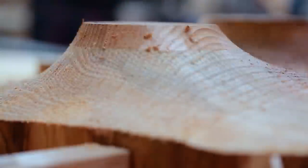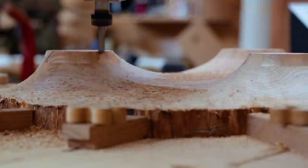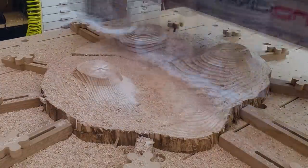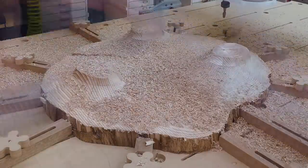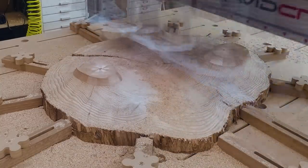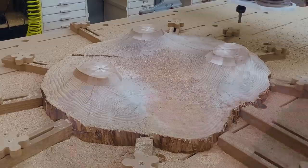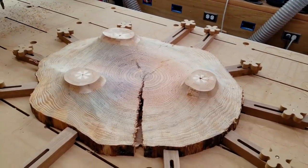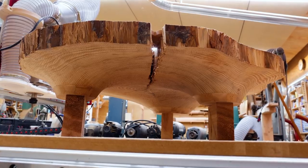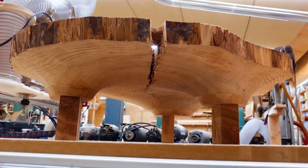Then I did a more finished finishing pass — same bit but with a tighter step on the passes, taking off a little more material. I did the rougher finishing pass first just to make sure I was getting everything with no gaps or holes, then the finished finishing pass made everything much closer to perfect. This really didn't take too long — less than an hour. That's what the underside of the table looks like. I'm going to stop this video here; this was a project in itself. The next video will cover making the legs, which is a project in itself.